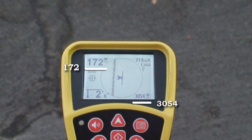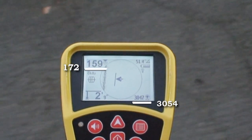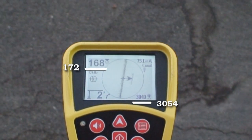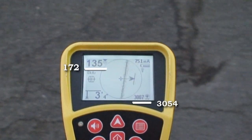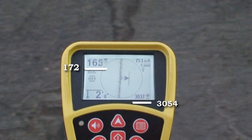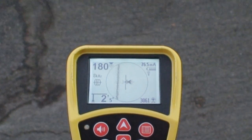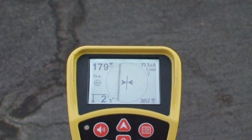Next, we'll focus on the proximity signal and the signal strength. We're looking for the point where each reading is highest. We're also looking for agreement between these two readings, and between these readings and either the tracing line or guidance arrows. These two readings agree with each other and with the guidance arrows, which means we have three independent readings that are in substantial agreement with each other.